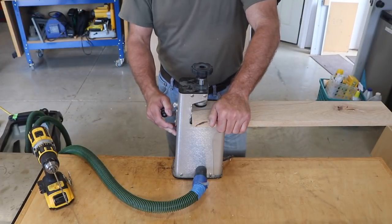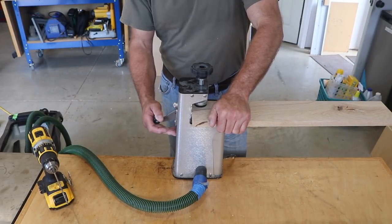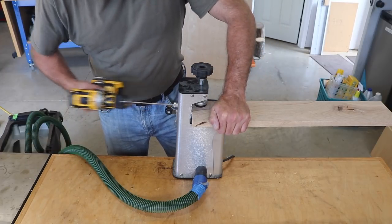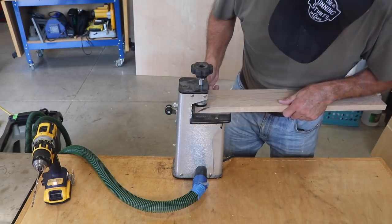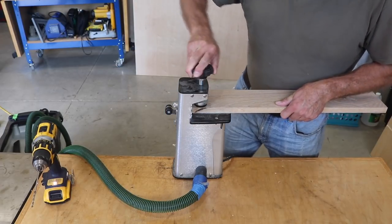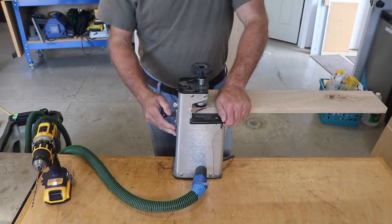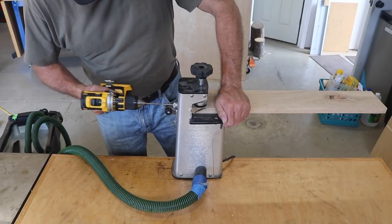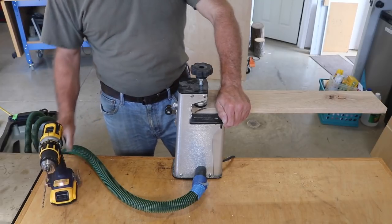This is the Castle 100. It cuts a really sexy, low-angle pocket for pocket joinery. To use it, you insert your workpiece into the throat of the machine and secure it in place. When I pull on this handle, it actually raises a cutter into the material and cuts the pocket. Then I follow up with a drill through the drill guide to drill the pilot hole.